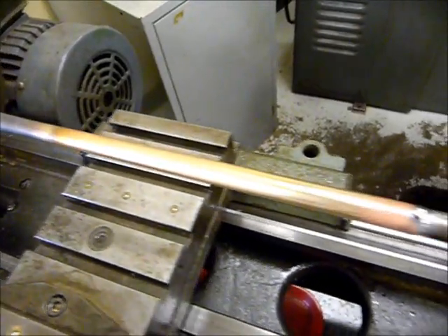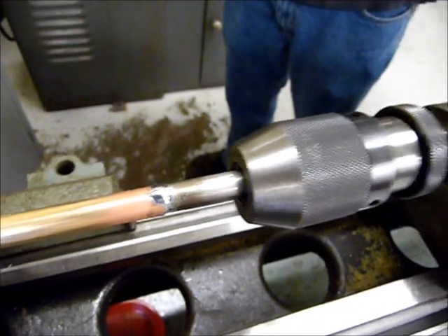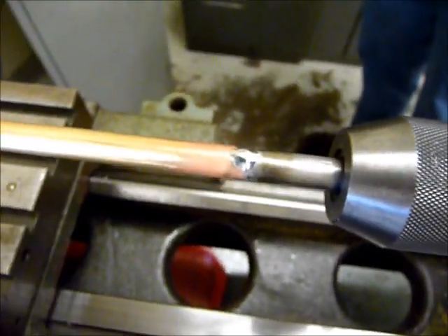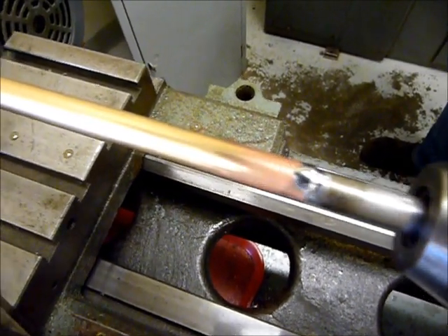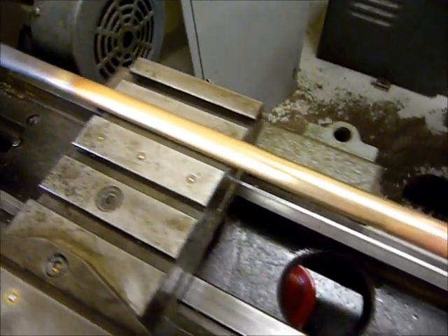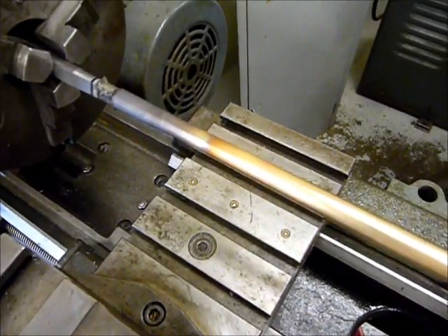One thing that's really critical is back here we have just a mouthpiece arbor that's attached to the chuck into the quill of the ram, and we soft-soldered the cutoff of the mouth pipe there to the arbor. That seems to keep it steady enough to do this. Otherwise, if you try to grab it in your hand, it's not going to work. So here's our setup, and now we're going to spin this.